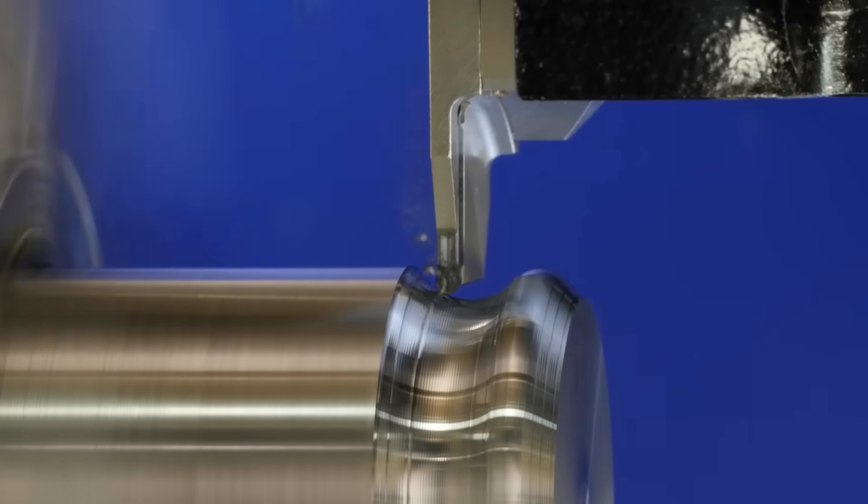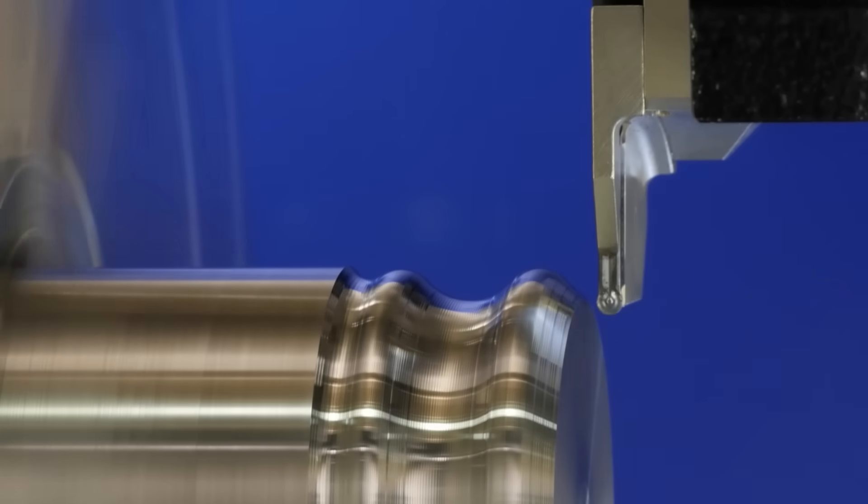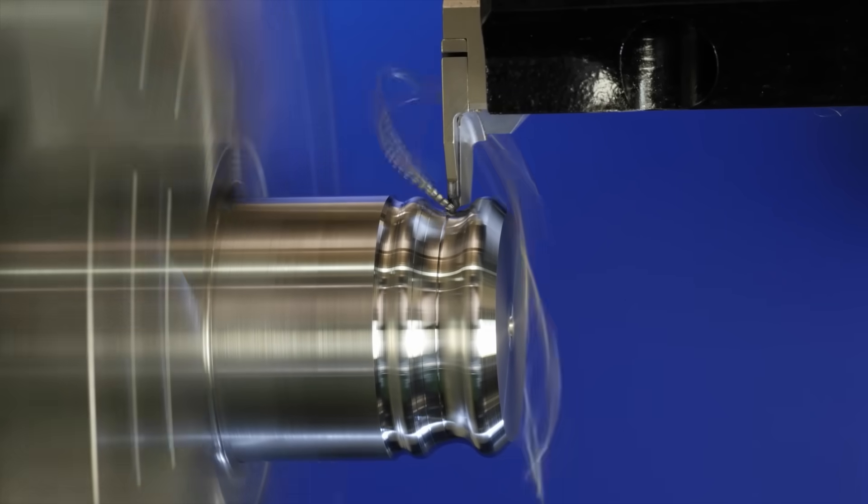And what do you think sets Vargas apart? Parting off, grooving, face grooving — all these things are quite generic, but really it's the support that we give with this product that makes us stand out. We challenge anyone to come to us and try to improve what they're doing. And this doesn't just replace existing grooving — this could replace existing turning of conventional CNMGs and VNMGs, and that's where we can help with that expertise.